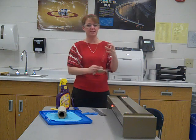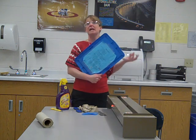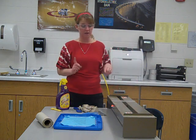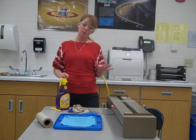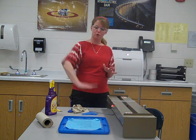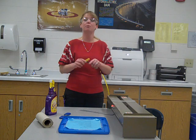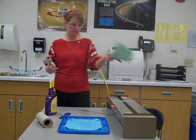Once I'm done cleaning, I want to find the center. Step three says find the center of your plastic — it's seven inches long, so half of that is three and a half inches. I mark three and a half inches and place it on the strip heater. If you cut it to the right length it should be the exact width of the strip heater. You're going to keep this on the strip heater for about two minutes or until soft. When you remove it, fold it quickly — use a book or assignment notebook to push down so you don't burn your hand.